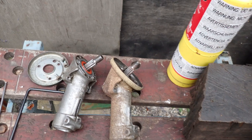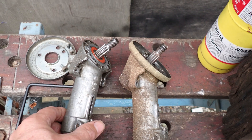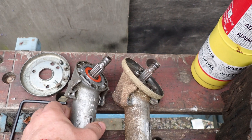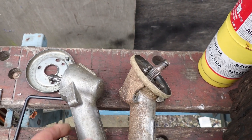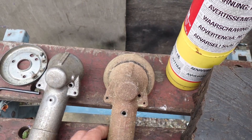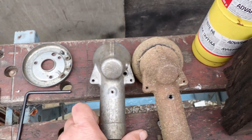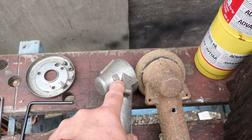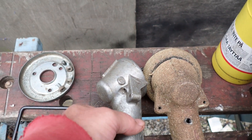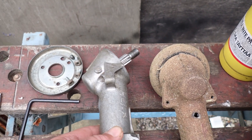We're going to look at some angle gears from an FS460 scrub cutter — that's a big Stihl. You can fit a whole variety of different tools to these, everything from a maxi blade for cutting down small trees through to a strimmer head. Very useful, very robust. The FS460 has been running for about 10 years; they've recently been replaced by the FS461, which has a redesigned angle gear incorporating a boss port where you can inject grease into the head to make the angle gears last a bit longer.